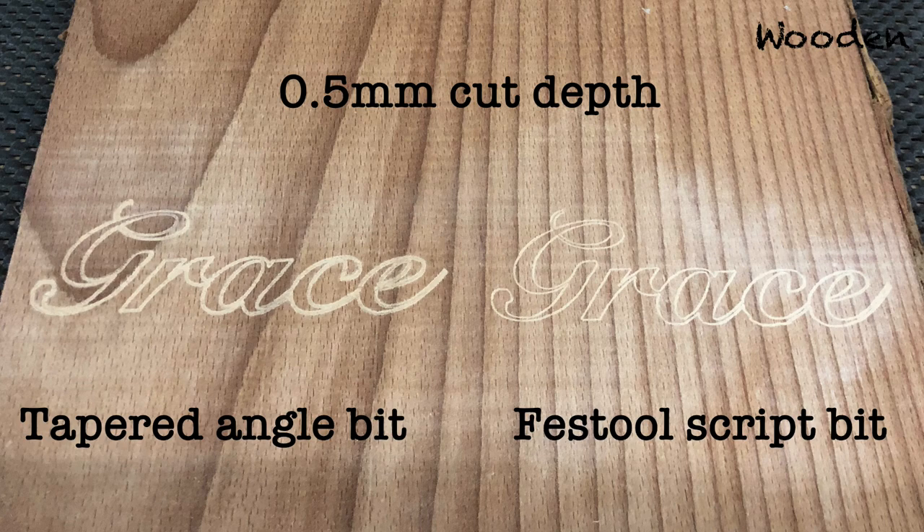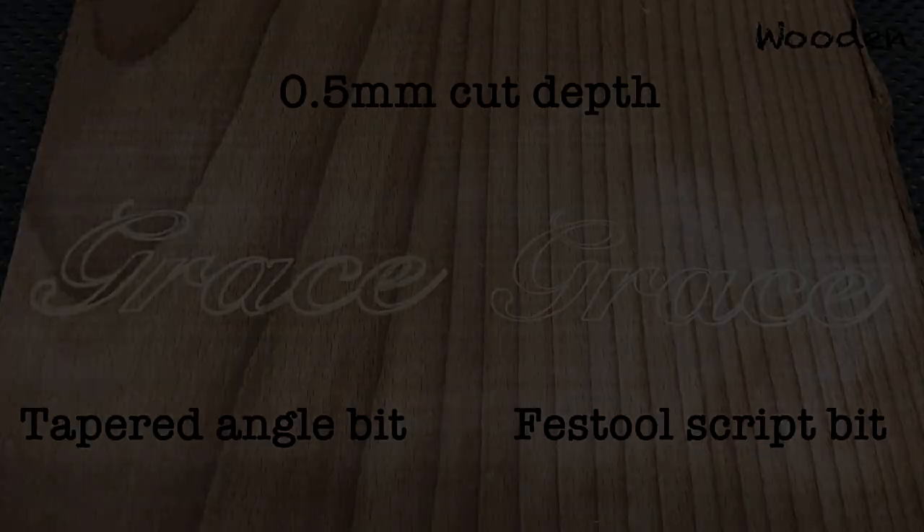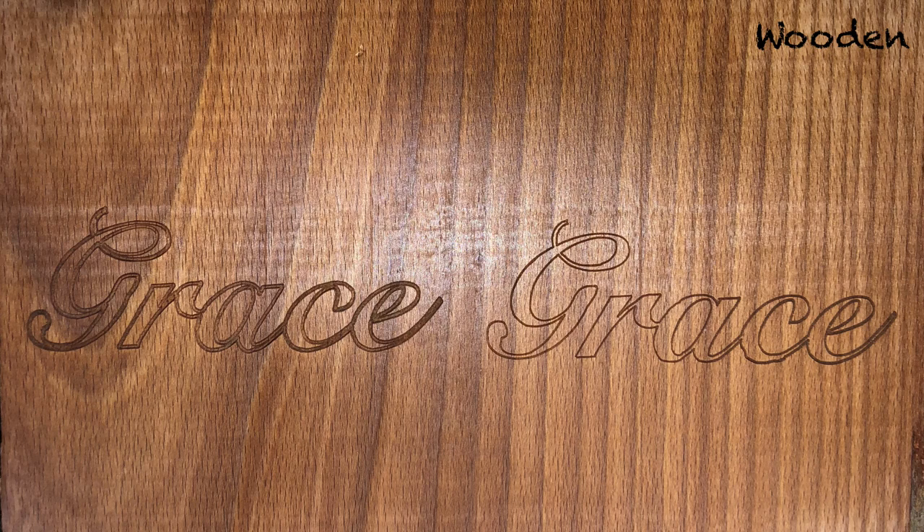It's kind of sharper. To make it easier to see, I filled in some sawdust, and you can see that the lines are much clearer with the script bit. Astonishing — a really good result for such a small font. As a reference, each name here is about 10 centimeters wide and 3 centimeters high, so it's pretty small. And here you see the same without the sawdust — really looks nice on the right hand side.